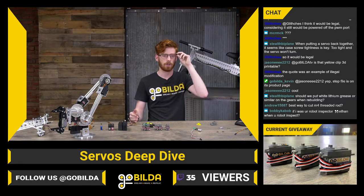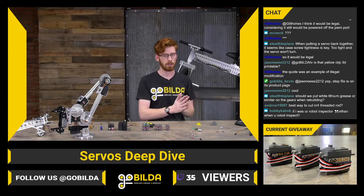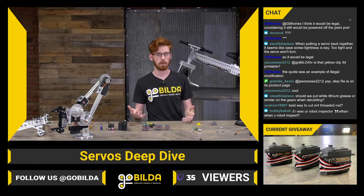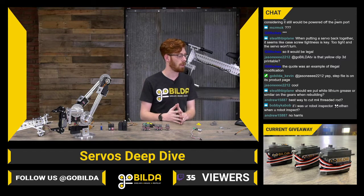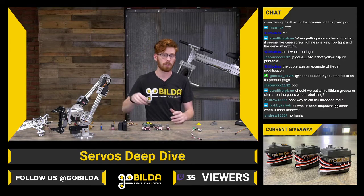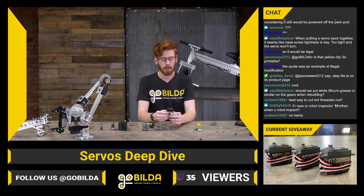You get a lot of the strength out of that gear set like you would out of a steel gear system, but your gear train is lighter, which means all that rotating mass that can sometimes be moving at 20,000 RPM can be cut down, and the inertia of that gear train can be reduced significantly, which is really nice. Coreless motors operate on that principle, where reducing the rotating mass can really help with increasing efficiency.